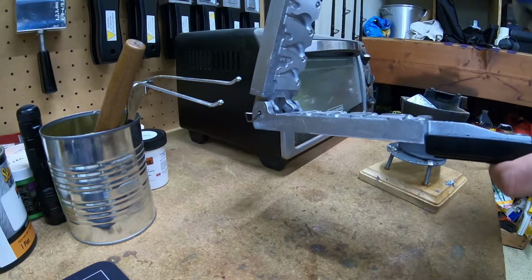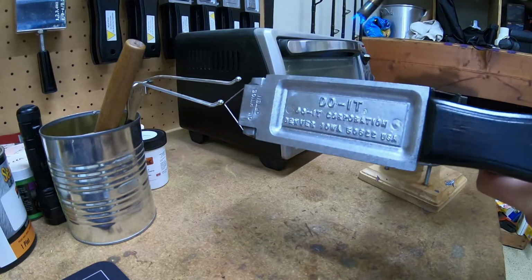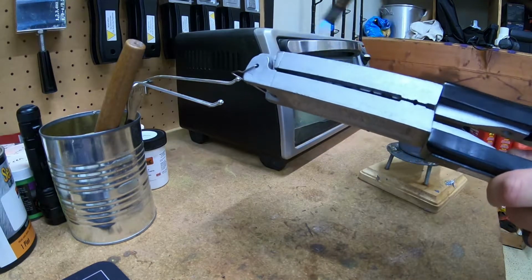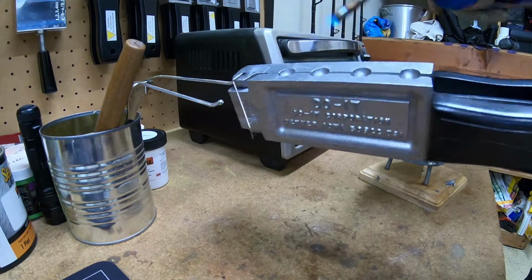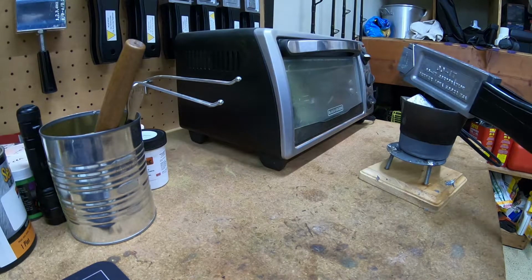When you're pouring hot lead into a cold mold, it might make it really hard to get the jig actually out of it. It sort of gets stuck into the cavity. But if the mold is nice and hot, then there's no problem. I know a lot of guys have had success lighting candles beneath the cavities and getting soot in there, and that helps with the release as well. And that also works.